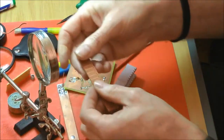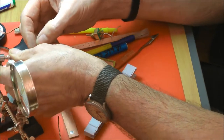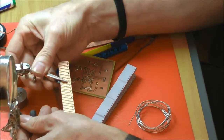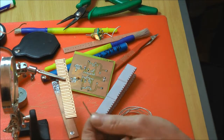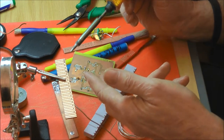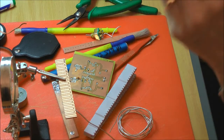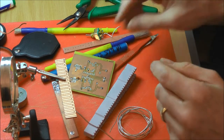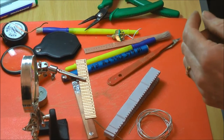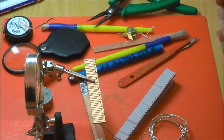So with that, try soldering that up without any additional flux. Personally, since discovering liquid flux, I use it everywhere and pretty well all the time. So again, use a heavier solder there. What we're doing when we're soldering, obviously teaching the majority of people to suck eggs, you need to bring everything to a temperature where the solder flows. One of the dangers I see when doing training is people are afraid to get the board hot. So they go very quick, and you don't actually get the heat in there, and you don't get the solder to flow.